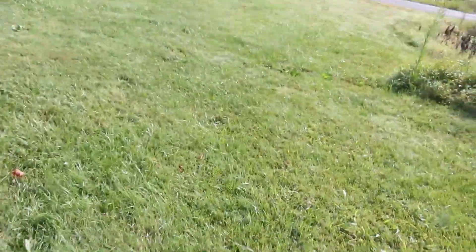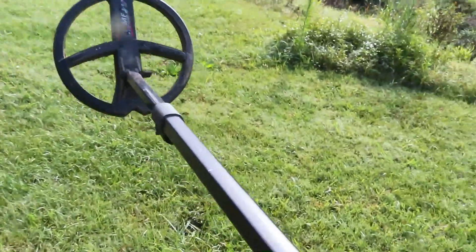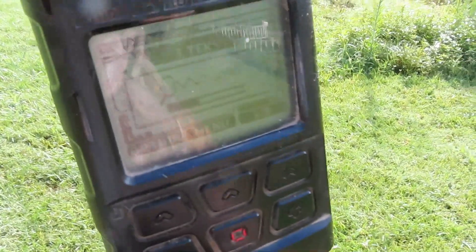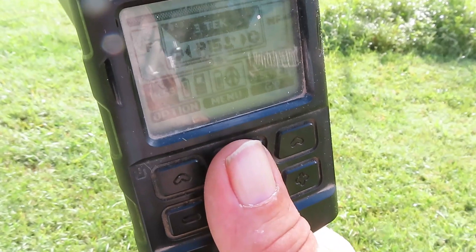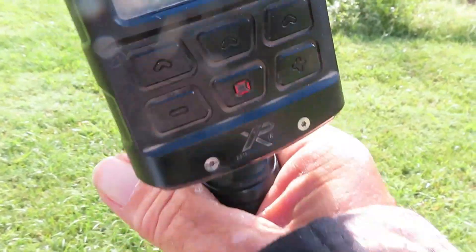So when you go to the field with this machine and you have auto noise cancel turned on, you change modes or you change frequency, it's going to go where it wants to go. If you do a user-initiated noise cancel like this, it's going to go where it goes. If it goes to channel 0, 1, 2, or 3 — and probably even 4 — I'm in 0 right now. I just walked 3 feet, did another noise cancel, and I'm at 0. Hunting in a high iron site, that's a no-no with this machine — or I'll say it this way: you can't go in there with this machine and pull everything out that's necessarily there.